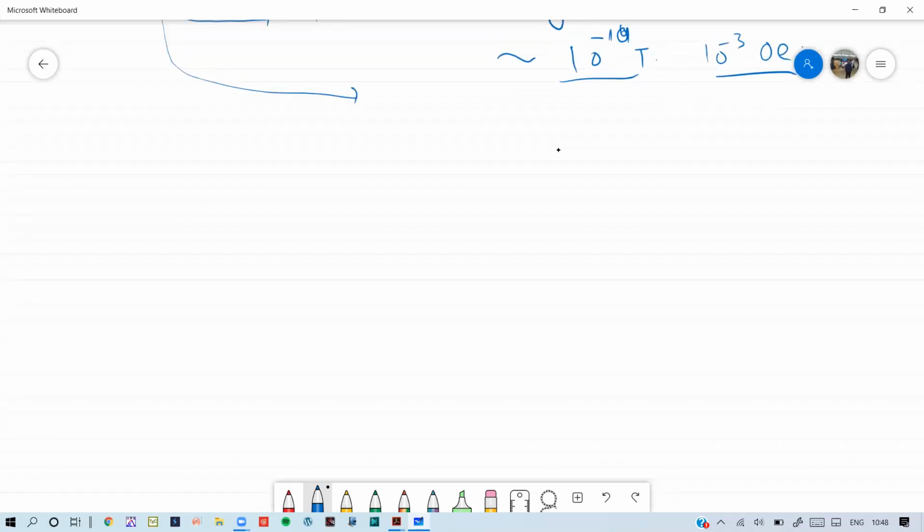This is another one. There are resonance sensors where magnetism and sound, or magnetism and acoustics, are related to each other. Then there are magneto-optical sensors. Magneto-optical means you apply, for example, MOKE. MOKE is a special effect, actually. It is a phenomenon where you measure the magnetic moment by shining polarized light. Polarized light means you polarize that incident light, wherein we only choose the magnetic vector of the electromagnetic wave. That laser or light is an electromagnetic wave. So you choose only its magnetic component.